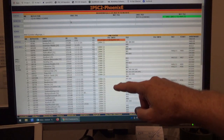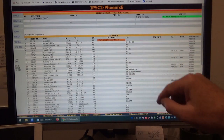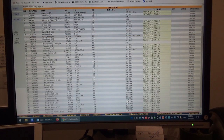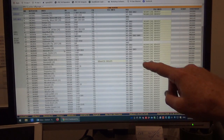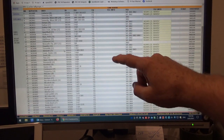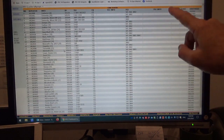For example, if I had the radio sitting on talk group 2351 and then decided to put out a call to a friend on timeslot 2, I'd be able to do that on a duplex while this conversation is happening on timeslot 1. That's where the duplex hotspot comes into its own on DMR Plus. On the VK DMR network the same applies — timeslot 1 and timeslot 2. If there was a conversation on talk group 505 and I wanted to talk to a friend on a timeslot 1 talk group — maybe 5, 8, 3810, or 3809 — I'd be able to have that conversation while the hotspot is also hearing talk group 5.